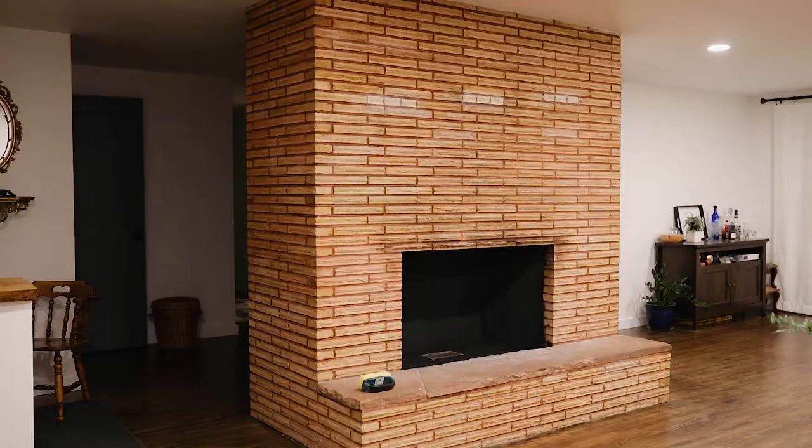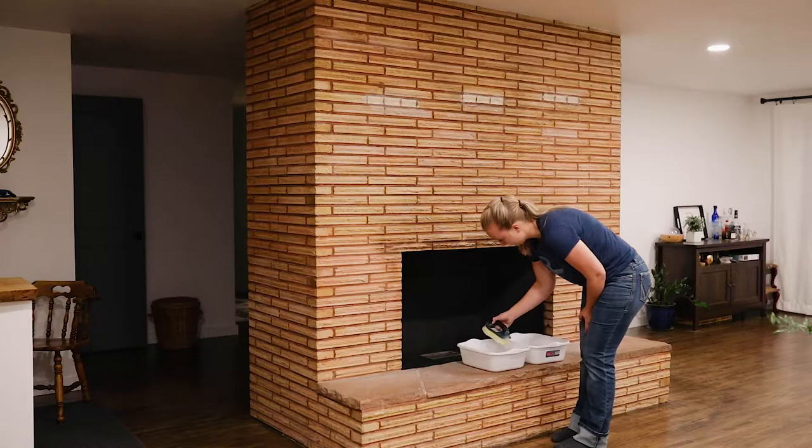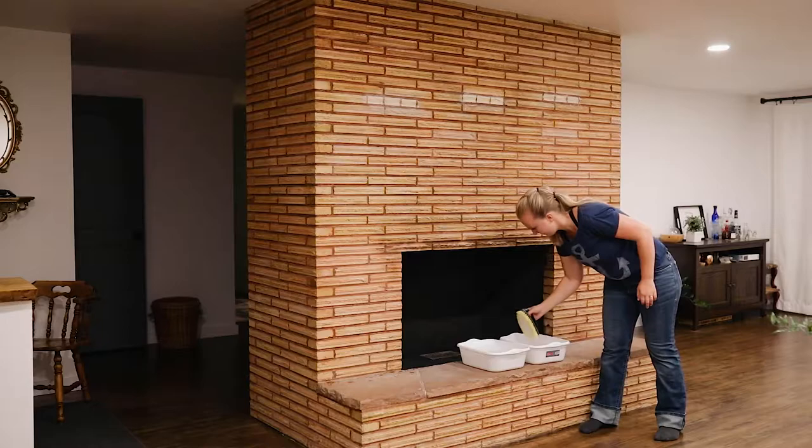Next I'm going through and washing all the brick because it was really dirty. If you look really closely you can see how stained it really is. I wanted the paint to stick really well to this, and it had quite a bit of powder still on it from cutting off those bricks. So I went through and washed it all really well, and then I let it dry for a day or two just to make sure we didn't deal with any moisture when we painted.